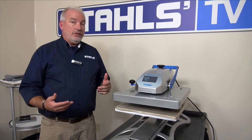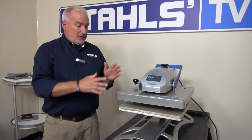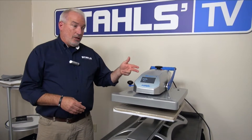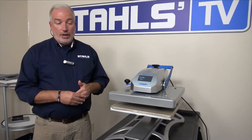What is the best scenario, ideal situation? You should have a 20 amp breaker that is dedicated just for this machine. Not everybody has that capability, but this needs to be the only piece of equipment running off that circuit. If you do not have the proper electrical voltage to the machine, it could malfunction, you would have less than perfect prints, and it could actually damage the press.